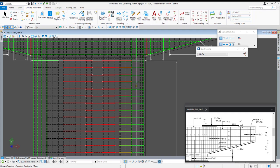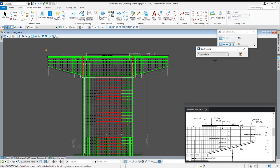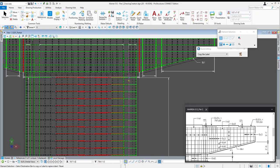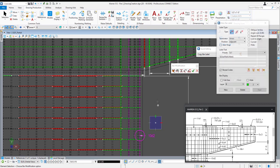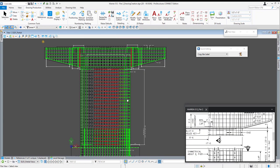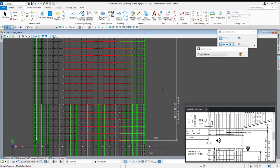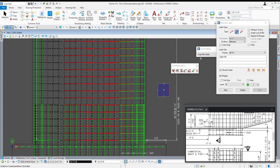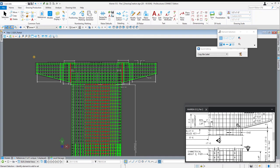I'm going to modify rebar on the verticals. Before that, I'll actually use my copy bar label to get that 10D1 copied up to our verticals as 10D2. Now I'm going to shift this up just a little bit because I'm probably going to clip out the middle of this detail. If I need any additional lines I can use the note tool. I want to modify my rebar and display all of my verticals, so I'll go ahead and do that — arrange display, detail all, hide delimiters, and accept. We can continue.